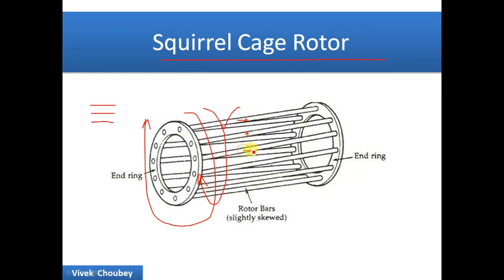As a result of cutting the rotating magnetic field, a current is induced within the rotor conductors. This current is sinusoidal in nature because the rotating magnetic field is sinusoidal. A current begins to flow through all these conductors, and this is the case of Lorentz force — a current-carrying conductor in a magnetic field feels a force. So these rotor conductors feel a force and tend to move in the direction of the rotating magnetic field, and since they are fixed to move in circular motion, they begin to rotate.